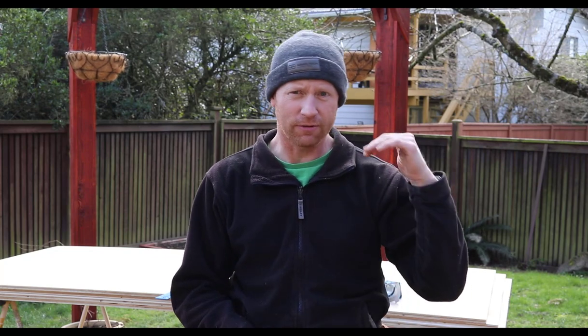What's up everybody, Dan here with Dan and Sarah Makers. Today we're getting into a skills video — I'm going to show you how to do formwork for a concrete wall. This could be anything from a short two-foot stem wall all the way up to a 16 or 24-foot tall wall. This is a pretty versatile system called the Jahn system — J-A-H-N. There are different types of brackets, it's not your standard hairpin or wedge type system, but it's extremely versatile, uses less lumber, and it's just an easy, clean type of formwork system.